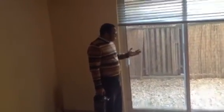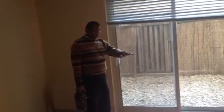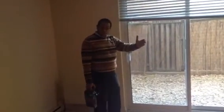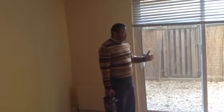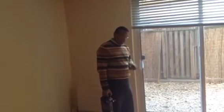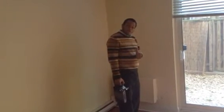The windows — the closer you get to the window, the colder it's going to be depending on the outdoor temperature. The easiest way to block this radiated cold — it's like putting your hand over a piece of ice, you'll feel the radiation of the ice hitting your hand — is to put a block between it. So here there are blinds. If the blinds were down, there would be less radiated cold coming in, and you could also put a dark curtain that blocks the radiated cold. That will go a long way in preventing the radiated cold from coming in.